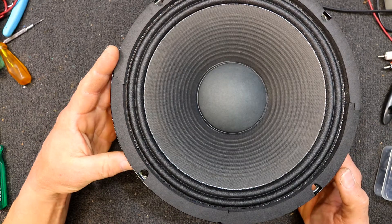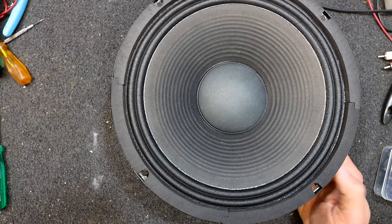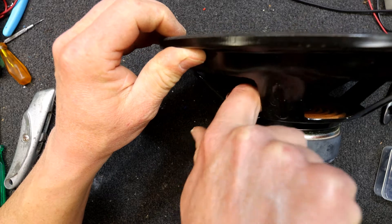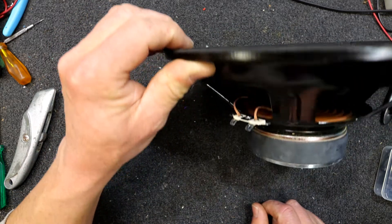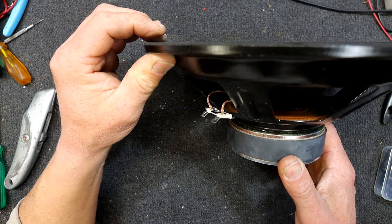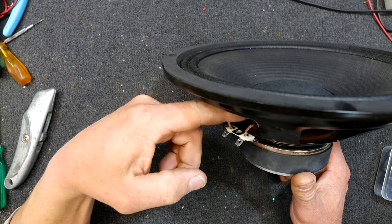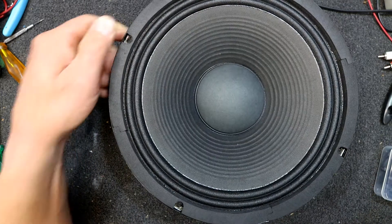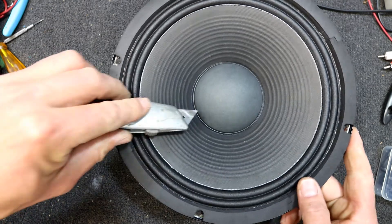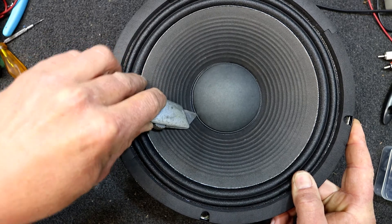I thought something different: I might cut the cone out of this and actually see if we can see why it's got an open circuit. I've checked back along these flexible wires back to where they go into the cone towards the voice coil, and they're all right. Sometimes you'll get a break in these just from flexing around too much. It's possible that someone's actually cooked this one, but another one was just sent to a lady and it wasn't working when she got it — possibly there's something weak in these that vibration damages.